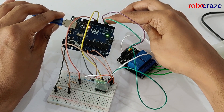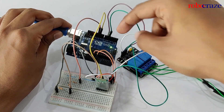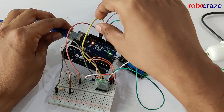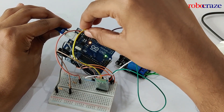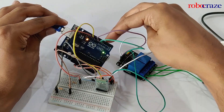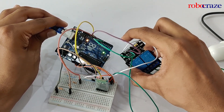There are 6 connections coming out of the Arduino Uno. These two — this is the 5-volt and this is the ground — is what you'll be using to power the HC05 module and the relay. The other two connections are pins 9 and 10, which you're going to use for UART communication between the Arduino and the HC05 module. Port number 4 and port number 5 are used to control relay 1 and relay 2.